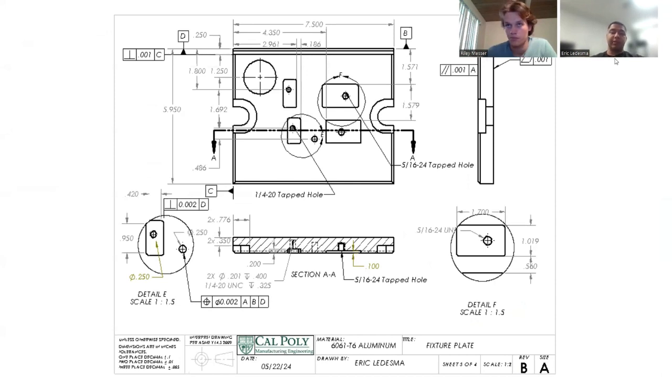This is the most important slide right here with the design criteria that we felt was necessary. As you can see, we have datum D acting as an indicating band, so you can line it up with the x-axis every time. Perpendicularity callout with datum C to make sure that thing is square. And then we also have the importance placed on the flatness on datum A, working with 1 thou there so that we have a parallelism of 1 thou on the parallel plate on top to make sure that that part is sitting in there flat every single time. We also have a positional tolerance on that dowel pin at the bottom left corner right there. We want to make sure that thing is locating and doing its job every single time you clamp, as well as the perpendicularity callout on that locating rail pocket.